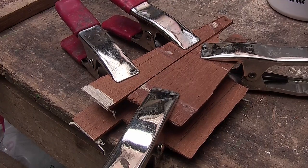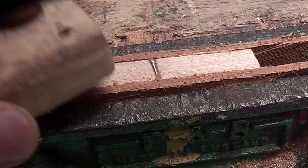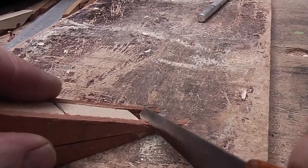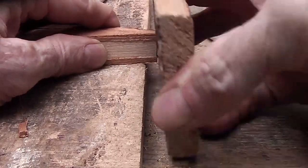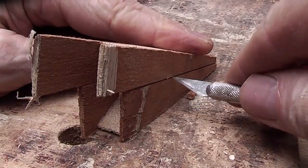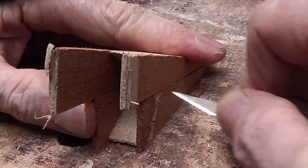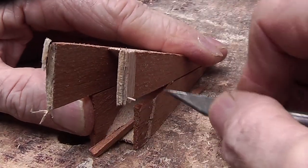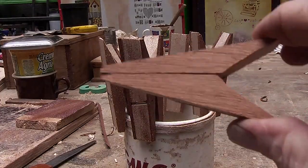Let that dry. Now putting it into the vise, I can plane that up and also sand it — use sandpaper instead of your plane to avoid risking blunting your plane blade. You can trim off the points, sand those flush, and with a craft knife trim this part here. Give the whole thing a general sanding, and there it is, ready to do a clamping job.